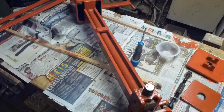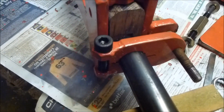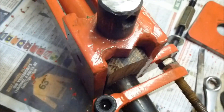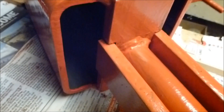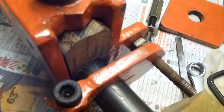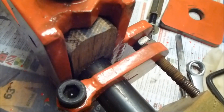The push rods are now fitted and I've also put on a depth stop — just a bolt so it can be adjusted. At the moment this is shown at the bottom of the travel, which corresponds to these rods being right at the bottom of the chamber. That gives the maximum swept volume of the piston compressing the briquette. I've made the depth stop adjustable so I can reduce the volume in the chamber, which might become important later.